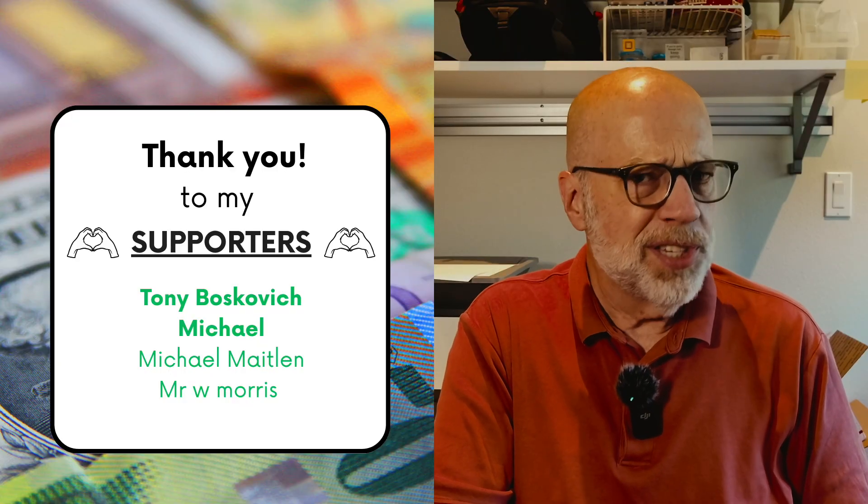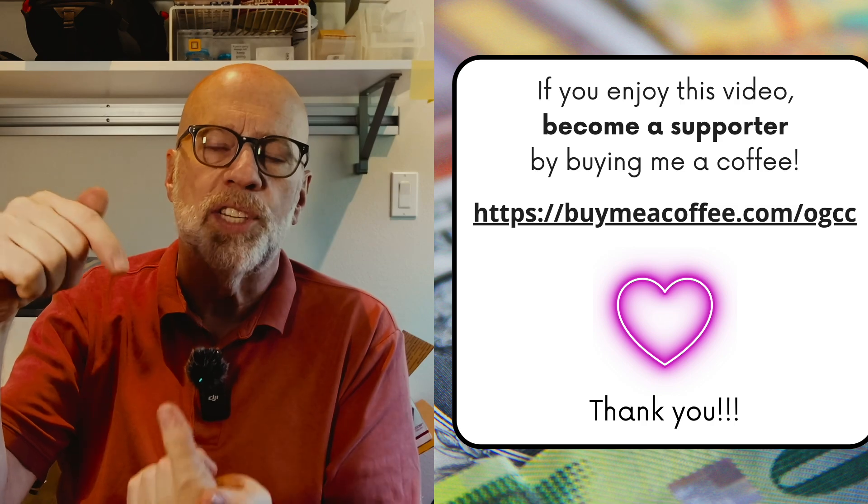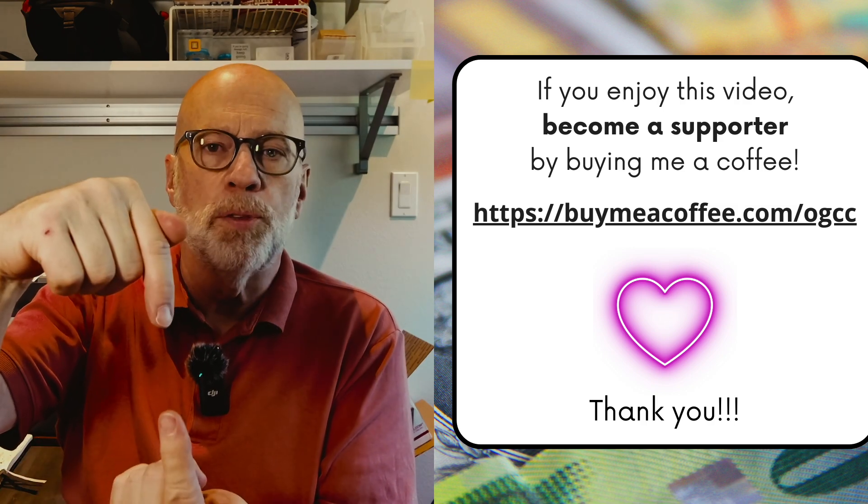Third choice is to use a staking set. The idea is to use a stump and a stake, or an inverted stake and a stake, with diameters smaller than the screw body. You clamp the body between them, then with your hand turn the plate clockwise or counterclockwise to unscrew the body from the plate. This is using the staking set as a screw extractor tool. I see the logic behind it, and normally I'm in favor of using the staking set whenever possible, but I'm uneasy about whether this could damage the stake tips.